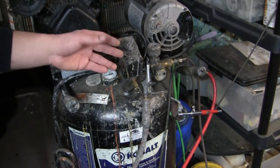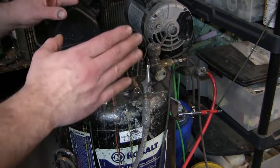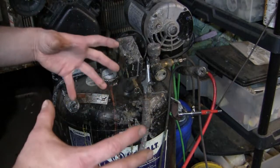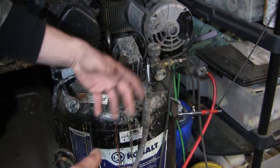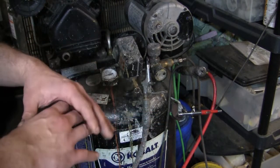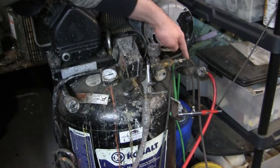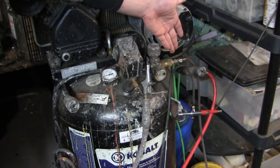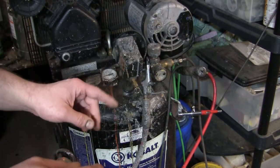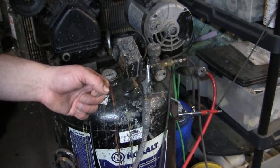This is why whenever I get asked what type of air compressor or airbrush to buy, I always tell them to buy a tool-type air compressor. What I mean by that is generally one that has a tank to it. From a 5-gallon or a 10-gallon unit, these air compressors can be found in any hardware store or even a place like Big Lots. With just a change of 1 or 2 fittings, which are a couple bucks a piece, you can get a system which will give you much better performance for a price tag that is sometimes lower than some of those consumer grade units.